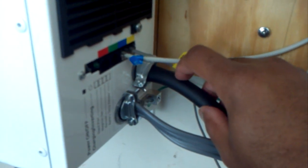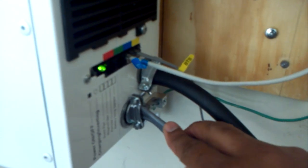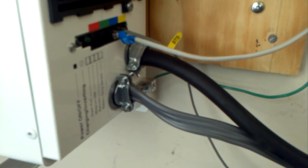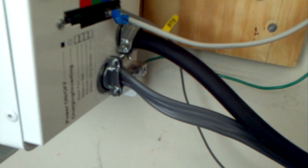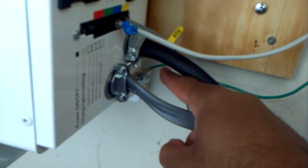There are two receptacles — one input and one output. I had to wire them on the inside of the inverter for 240 volts, both of them. This is 12-gauge wiring — a three-wire system with two hots (black and red), a white neutral, and a ground. This is heavy copper 12-gauge wiring, and there's also heavy-gauge 240-volt wiring on the back along with the equipment ground block. The inside is also system grounded.